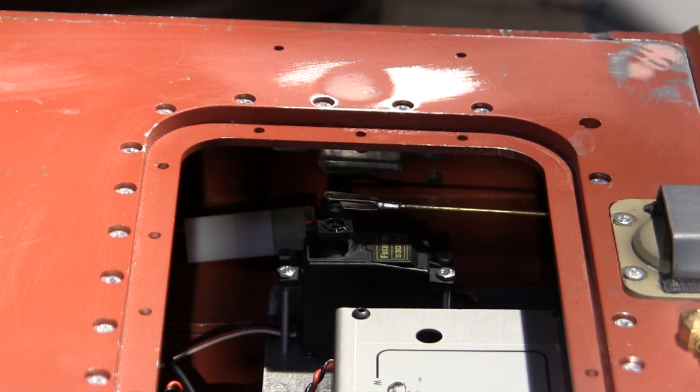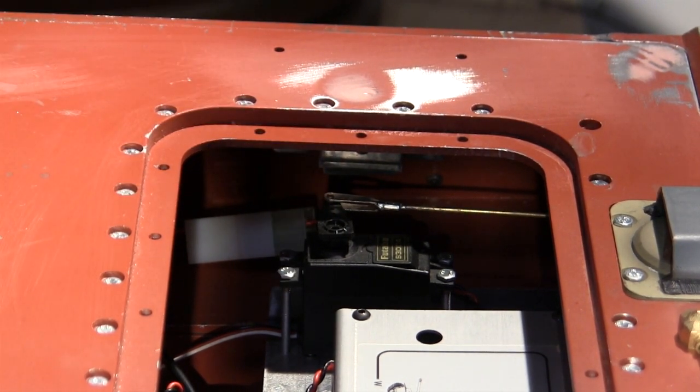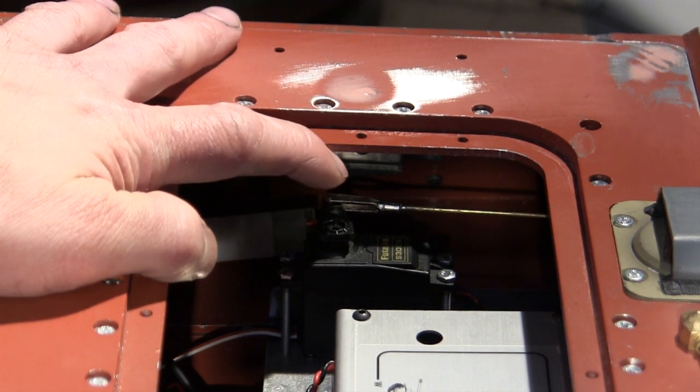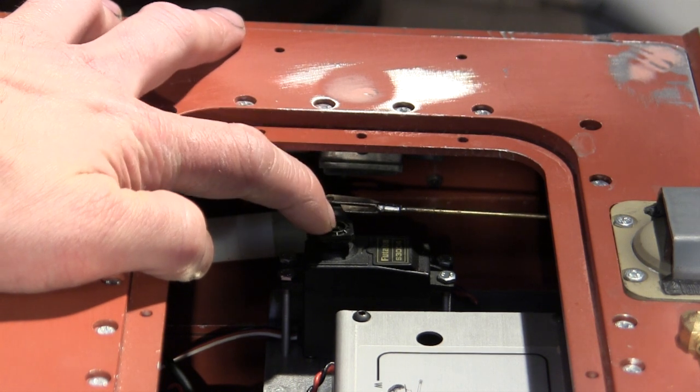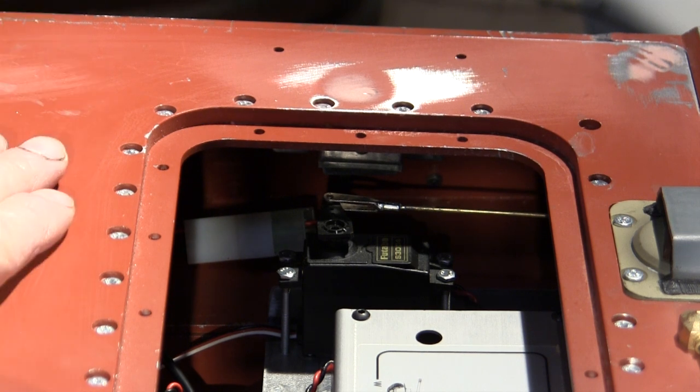However, there is one warning I want to point out, and that involves the clevis that we have here. You see, with the way the servos are designed, you put the clevis into its appropriate location, and then you have this retention screw that gets tightened in place and keeps everything where it needs to be. For this servo over here, I'm not going to be utilizing the retention screw. The reason why involves the top deck.